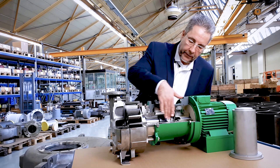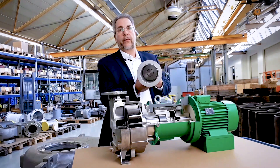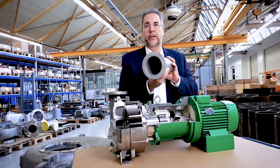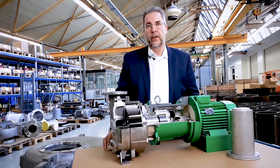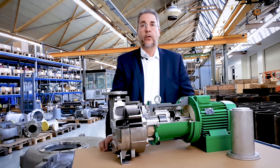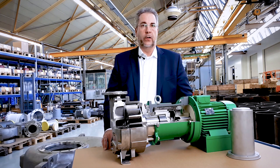These two rings are separated by a shroud, which is more or less shaped like a pot. It is made of low-conductive materials, like titanium, Hastelloy, or performance plastics, to avoid and minimize eddy current losses.